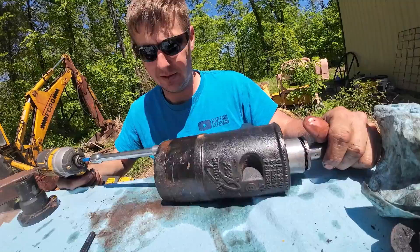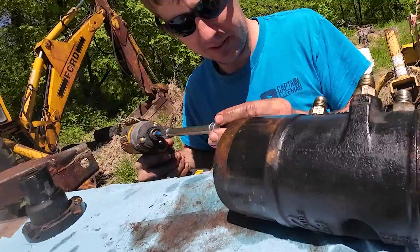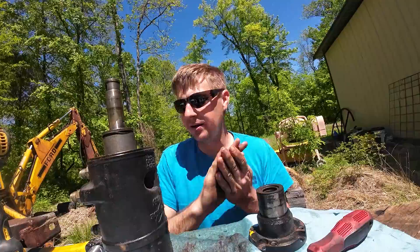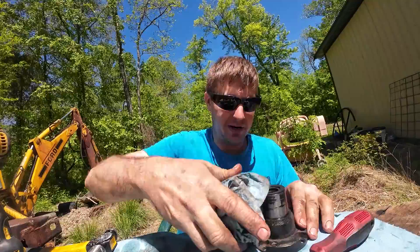There is a torque sequence in the book — we'll follow that. The big tip if you go to take this off: down pressure on this so it doesn't pull all those pump components out. It's that little drive gear down in there that got unaligned; had to take the bottom part to get her back together. Don't lift by that.